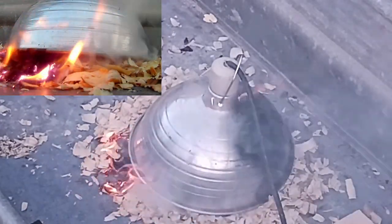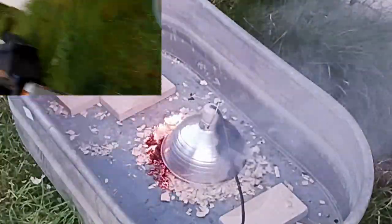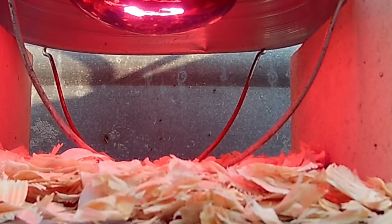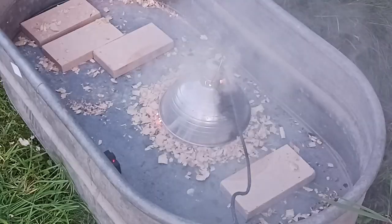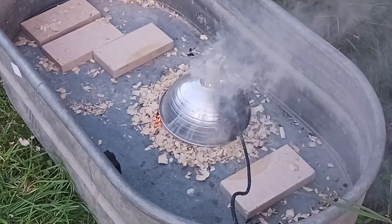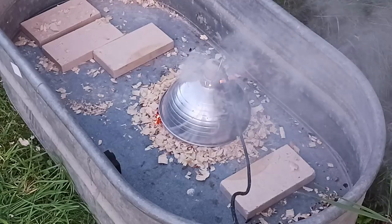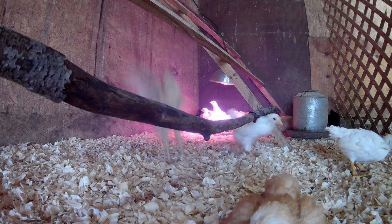After conducting this test, I've come up with some pretty reasonable conclusions. Heat lamps that fall onto bedding material with a guard in use get hot, but not hot enough to combust common bedding material. Heat lamps that fall onto bedding material without a guard get hot enough to combust common bedding material. All of that is certainly interesting, but we're not quite done yet.